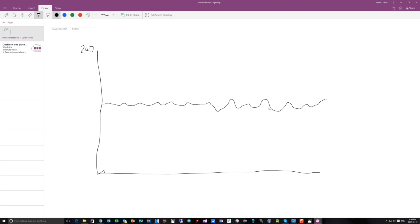Now, the analog output using out 2, you could be monitoring with a PLC, and you could have some kind of alert set so that if the power consumption goes above, let's say this is 200 watts, it creates an alert for you because it's going above a certain threshold. You could also be monitoring the current, or the power being consumed by the motor, and looking for trends.